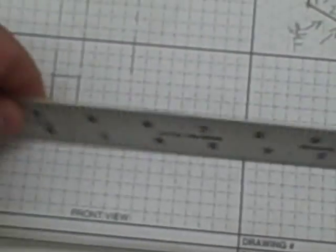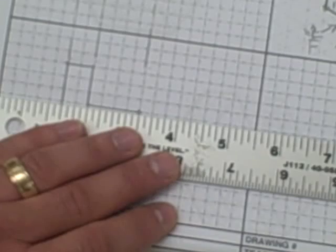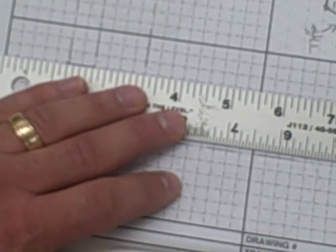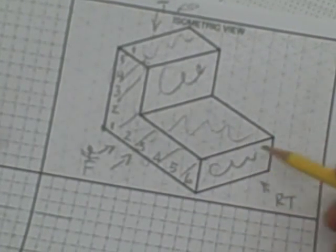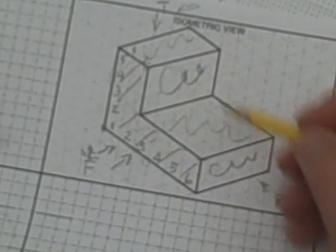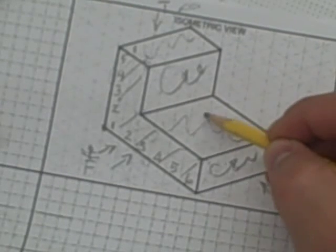And that's the front and top view. I'm also going to need projection lines to go from the front to the right side. So I'm going to take my ruler, line it up with the shape, and bring these projection lines over to the right side. This tells me how tall it is and where this step down is. If I look at the right side, I'm going to see this surface here and this surface here — surface one and surface two. This is two squares tall and four wide; this is three squares tall and four wide. When standing here looking, it's going to look like this is right on top of this because I won't see that other surface.